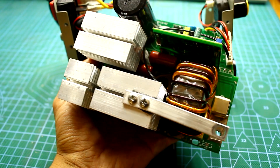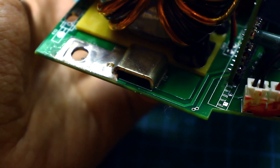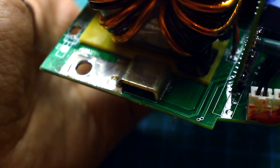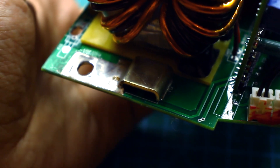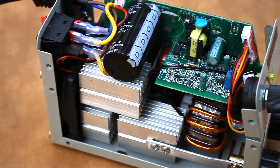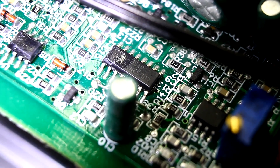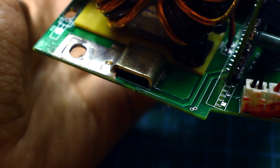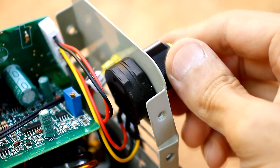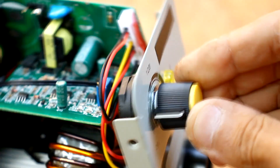Regarding current feedback, to be honest, it is not very clear. There is both a current transformer and an output shunt. Most likely the shunt is used as the current sensor, and additional protection is built on the basis of the current transformer, although I am not fully sure. The control board is separate. It houses a PWM controller, a standby source microcircuit, and several other microchips whose markings aren't visible due to a lacquer layer. Most likely these are operational amplifiers, on the basis of which are built a voltage amplifier from the shunt, feedback, and overheating protection.